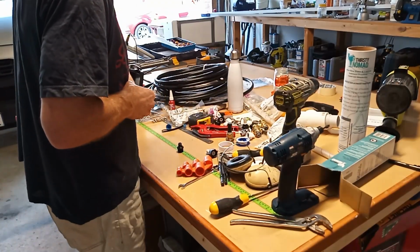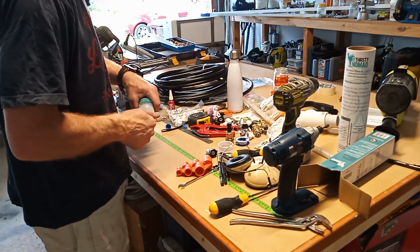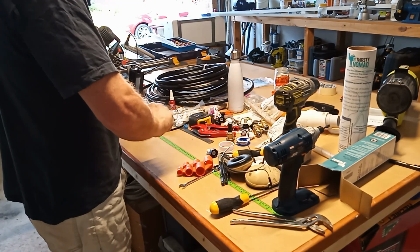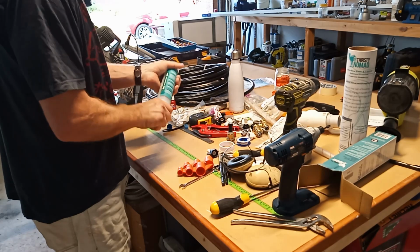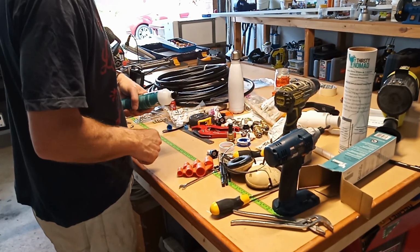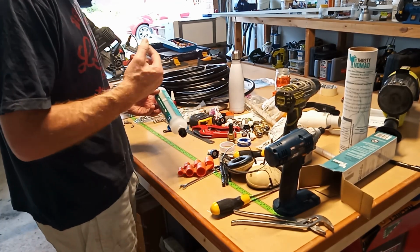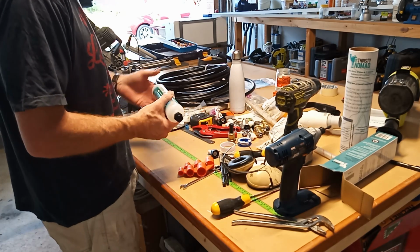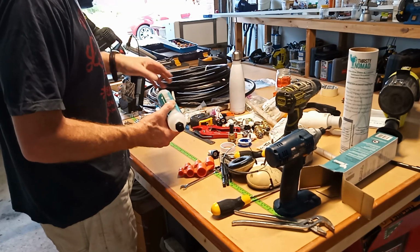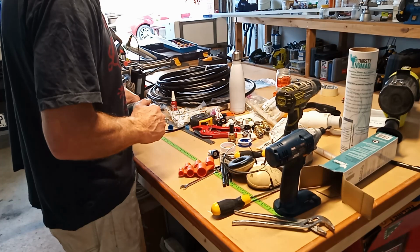Water filters are designed to be used with cold water, and cold water is defined as below 40 degrees, so it should be fine for what I'm doing, even though for the shower I'm heating and reheating the water. This is before going through the heat exchanger, so coming out of the tank through the filters, the water should be less than 40 degrees.